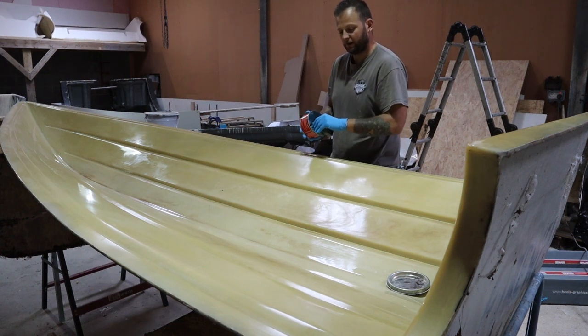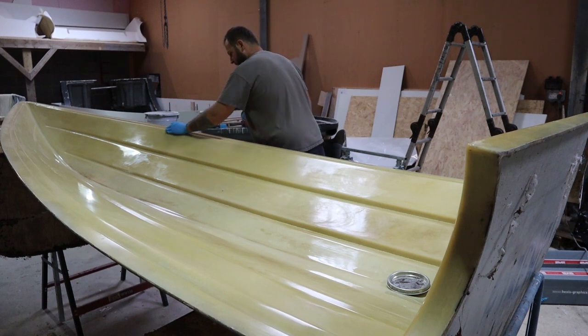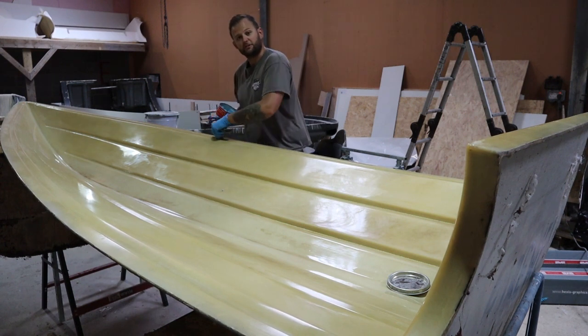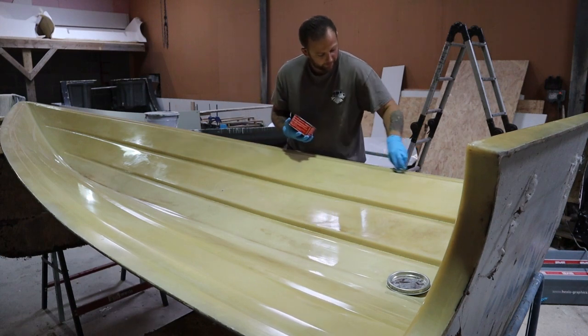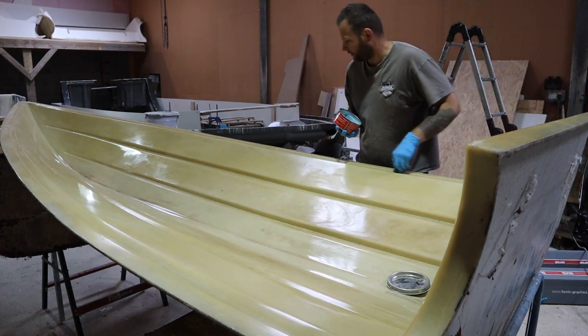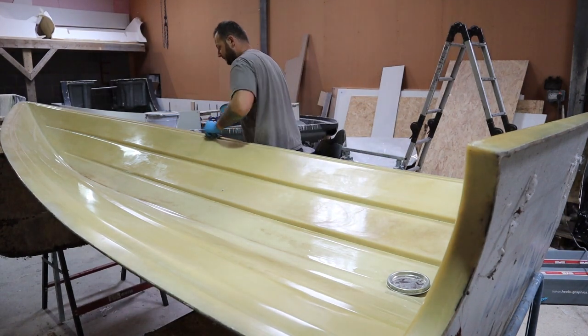So applicating this, we really want to look at applying between 6 to 8 coats of this mould release wax. Make sure you're getting all these tight little corners and things like that. Just break any remaining bits of polishing compound, because you should have cleaned it by now. So it should just be polishing compound left in these little corners.